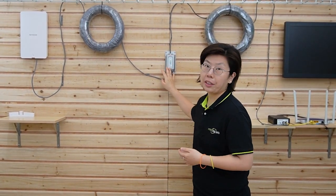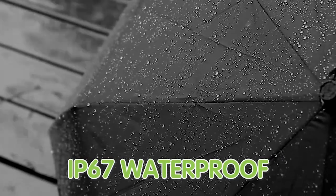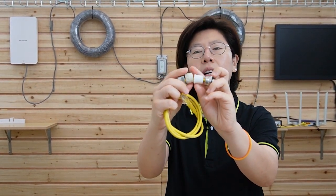One more thing — since this is a full metal housing PoE extender, it has corrosion resistance to protect the metal and extend its useful life. It is also 100% IP67 waterproof, so it can work in harsh environments. The working temperature range is from minus 40 degrees up to 75 degrees Celsius. There is rubber inside the gland — when you screw it together and tighten it, it prevents water and dust from getting into the cable, which is why it's rated IP67.